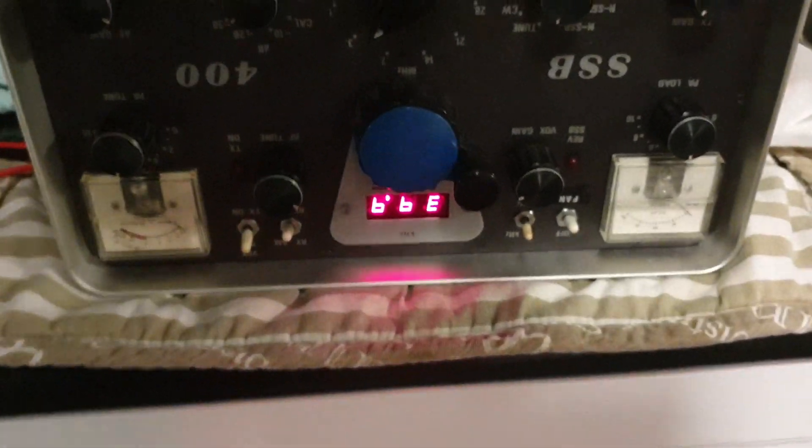See the spark? That's a dry joint — working, not working. Initially we checked voltages here, here, and here and thought they looked pretty good even though we haven't got a circuit for this yet. Then I just found this little spot here — look at that — bang, off, no lights, nothing at all. We re-soldered that back on there.